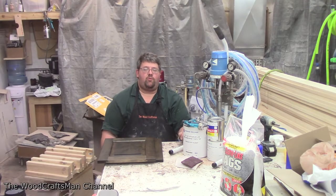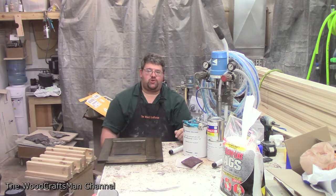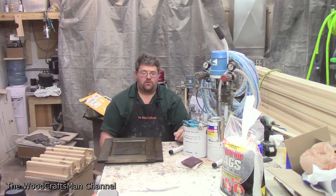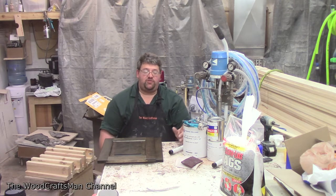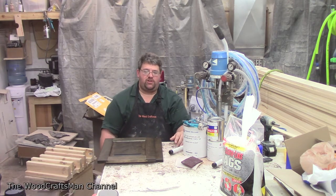So this is another waterborne wood finishing demonstration. I'm going to be demonstrating the Sherwin-Williams product finishes product line from their waterborne series. I'm going to be using the Sherwin-Williams Sherwood Water Reducible Wiping Stain S64 Series. I'm going to be finishing it with two coats of the Sayerlack Hydroplus waterborne finish in a 20 sheen.